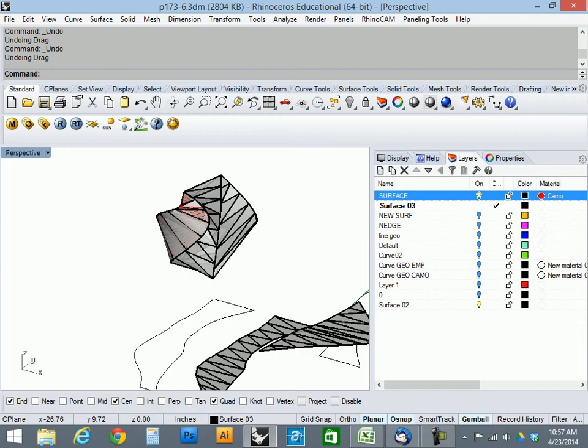I know you guys want it to be where you just sit down and you just go A, B, C, and you're done. Unfortunately, to do this type of fabrication, it's not possible, right? You're testing things, you're working this. I would take this pattern, print it out 11 by 17, cut it out of foam, put it together. Is it doing what you think it's doing, right? You don't want to spend all this time cutting the material and then realizing, oh no, that one was mirrored, and then you have to cut it out again. So testing this before you go there, I think, is critical.